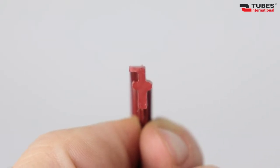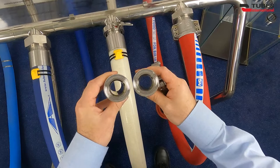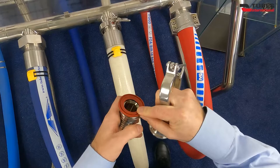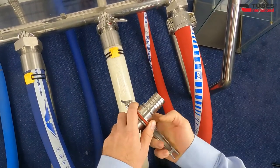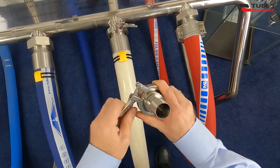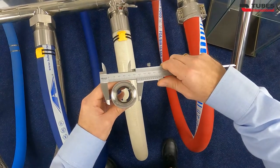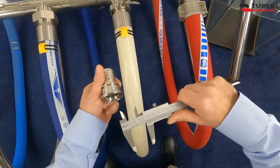The seal in silicone, PTFE, Viton, EPDM or NBR rubber entirely fills up the crevice between two flanges and thus ensures unrestricted flow path and a very high level of hygiene. That is why triclover couplings are used in many applications in pharmaceutical industry, cosmetics and biotechnology for liquid and high viscosity media. It is specific to triclover couplings that the outer diameter of the flange and inner diameter of the outlet correspond to each other and to the inner diameter of the pipes in the pipeline.